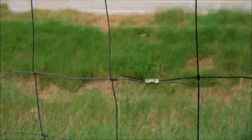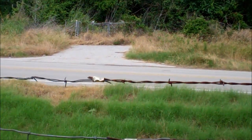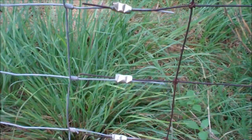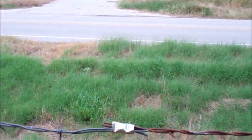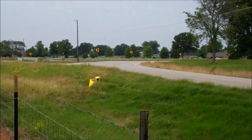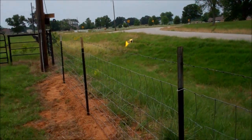You can see all my splices down here that I've done on the fence, on the woven wire fence. I did this one a little bit different than what I showed you in another video. I just went ahead and put the splices on each row, on each level, on each wire, and then spliced it here. Somebody came through — you can see a sign laying down, and I need to get this off the tripod; I can't handle it good.